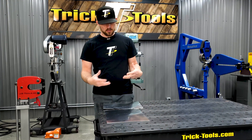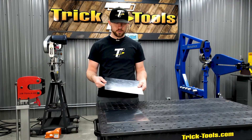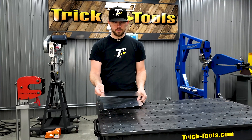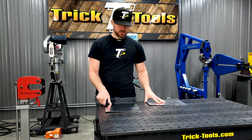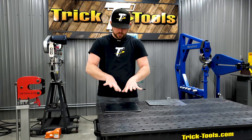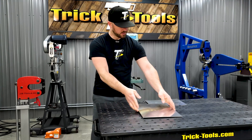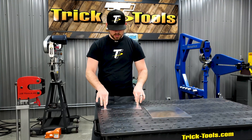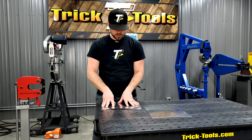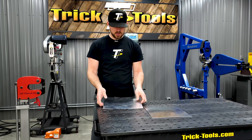It's a reference to looseness in sheet metal, whether it's welded in or not. I have two different panels here with two different types of oil can. This front one: if you push on the center it pops the other direction and stays either way. This other panel has a lot of loose floppiness — if you press it down it wants to spring in different directions.